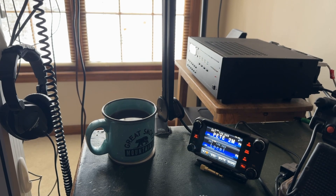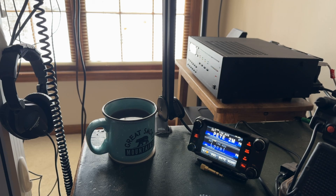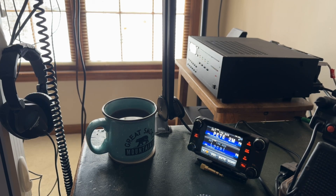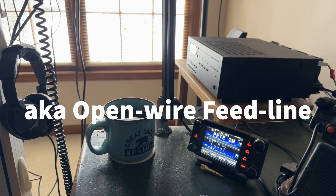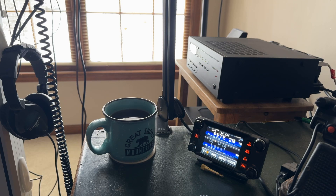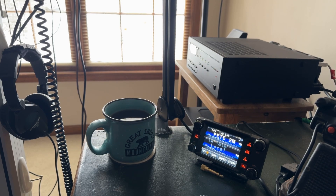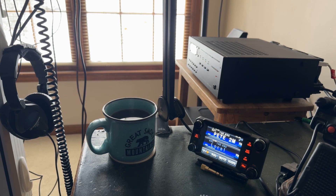The snow is a conductor. What about even just plain rainwater? I have a ZS6BKW and a doublet antenna system that I built — it's a 160-meter length. You feed those with ladder line. The ZS6BKW is in the doublet family. A doublet is basically a dipole fed with ladder line. Ladder line, when it gets wet, will skew the SWR. With ladder line, the reason it's good is because it's low loss with a high SWR, because you've got equal and opposite flow in each of the wires. As water collects on it and drips down it, it upsets that, so it'll throw the SWR off.